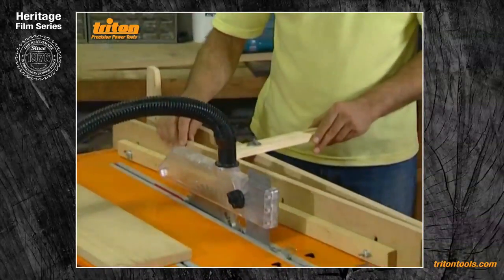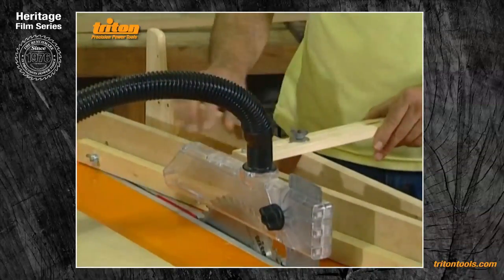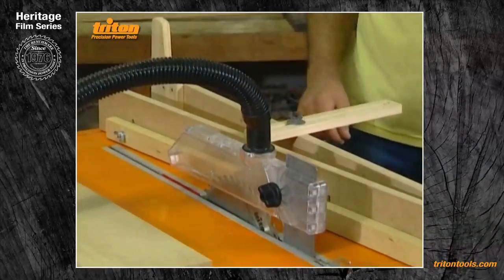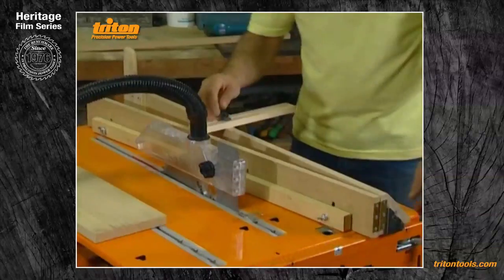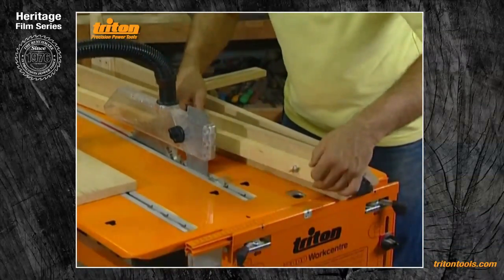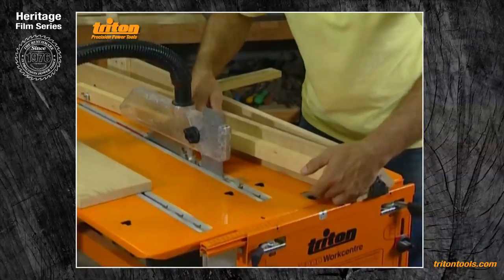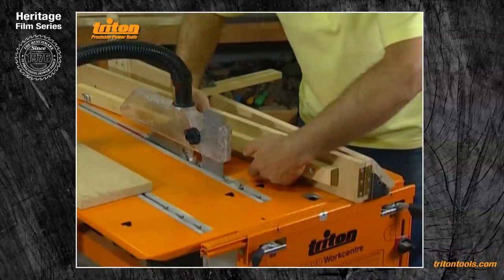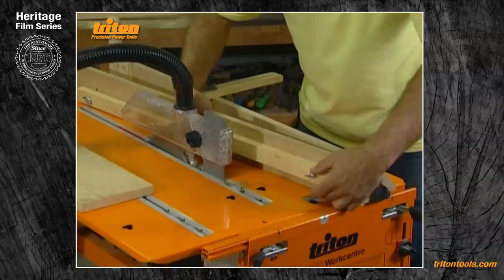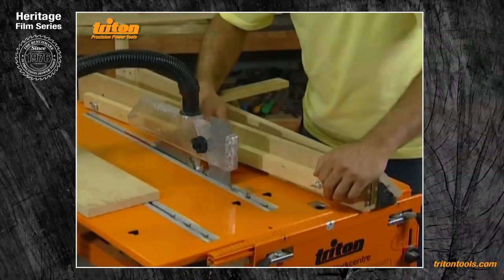And it's adjustable in the angle by means of this slotted strap here, where I can tighten this wing nut when I get the angle that I want. There are a couple of other little niceties on this jig. These little hold downs. Now they're just pieces of wood mounted on slots to give you different adjustment heights for different thickness of material. And there are little nails protruding, just the points of the nails protruding on the underside, just sticking out about 1.5 millimetres or so. And they'll help to grip the work as I'm sliding it through.